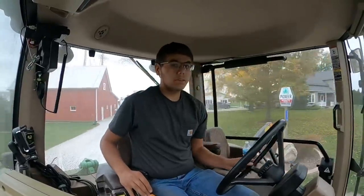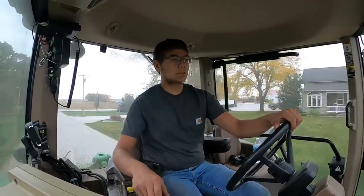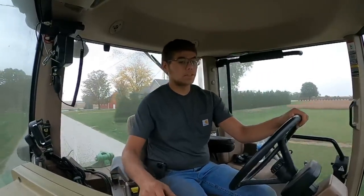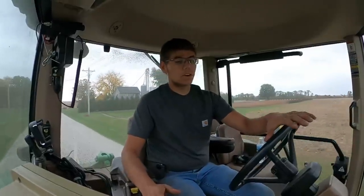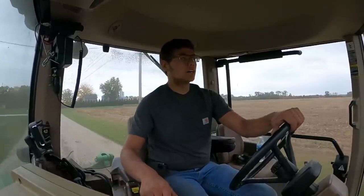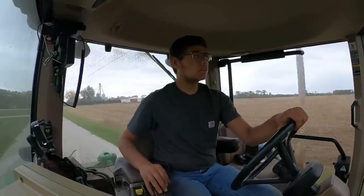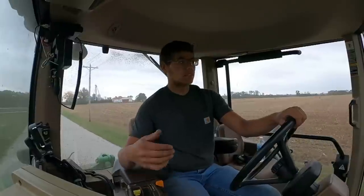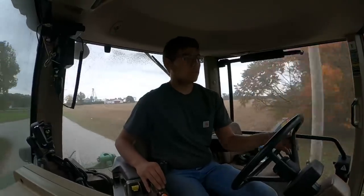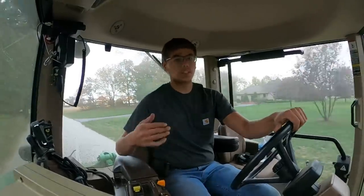So they reprogrammed the controller in the armrest after I replaced it. And the problem was, there wasn't an issue as far as programming the tractor goes for recognizing the controller. Back when we bought this tractor on auction, there was a single lever control arm for the loader, because this tractor actually was ordered with a loader by the original owner, and when we bought it on auction, they separated the loader from the tractor, and we just bought the tractor, but they wouldn't take the joystick out.